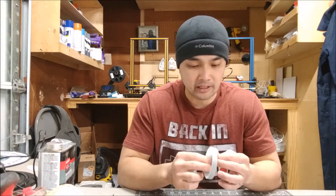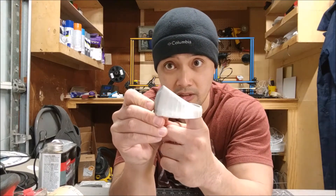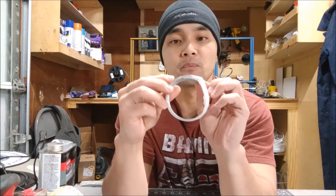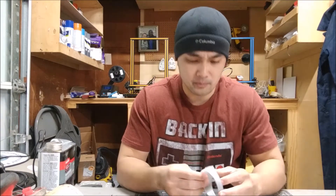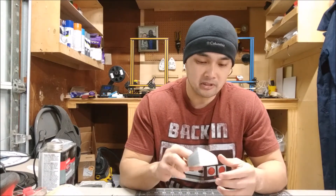I've also printed it at 0.1 millimeter layer height. It's clear plastic, so you can almost see my finger behind it. I also sprayed one side with filler primer, and I think filler primer is going to do well to post-process this — I just need to play around and experiment with it. It's a good filament, you guys. This one printed at 0.1 millimeter layer height with 10% infill, one shell versus two shells on the other one, and the one-shell version is a lot squishier.